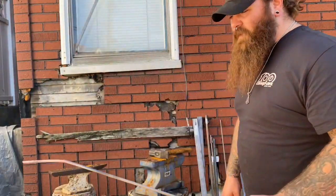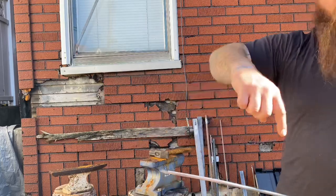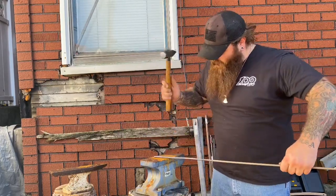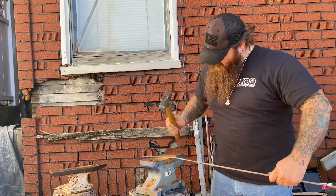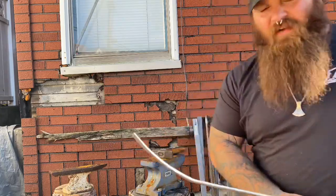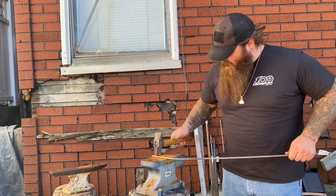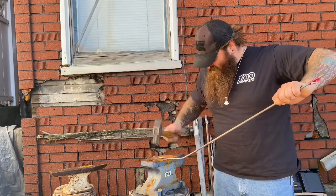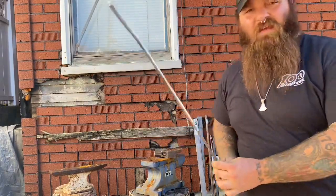What we're going to do — I already put it on a little bend because that's where I'm going to have it at a 90. But before I do that, I want to draw this piece of metal out a little bit, and what I like to do is turn it into a square all the way down like this. I don't know if you can see, but it's starting to become a square. It developed a little bit of a curve so I'm going to flatten that out, but I'm still putting that square on it so I can draw it out. I'll bring it up to the camera so you can see — see how I squared it out.